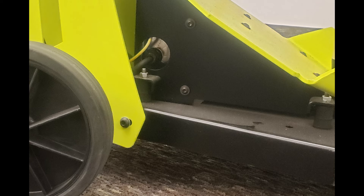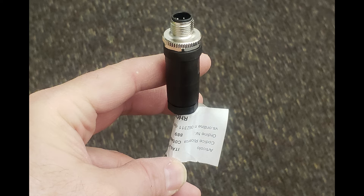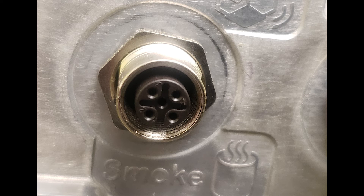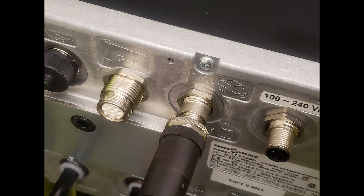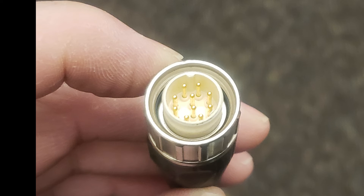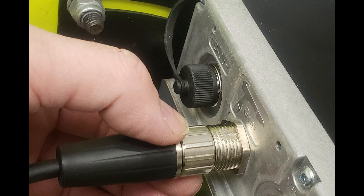For connections of the electrical cables, the vibrating motor cable is connected at the motor under the table, then ran up to a junction connector on the rear of the cart and runs to the control box. This connector has four male pins along with a pin guide notch, and is attached to the rear connection labeled VIB. The gun cable, which is ran through the hose bundle, has a 10-pin male connector and will be attached to the control box connector labeled gun.